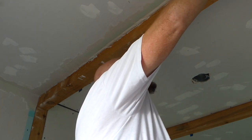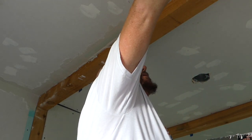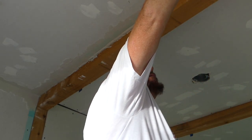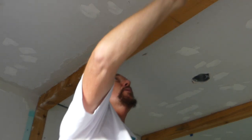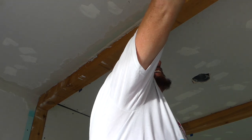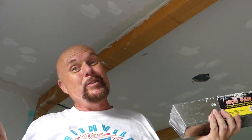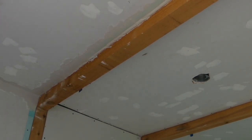We'll see, internet, if it ends up falling apart or if what I said is true, that plaster loves timber. Especially this, it's rough cut, right? And I did the right thing by avoiding adding a stain or finish or anything. It would have made it easier for the final fit and finish of the timbers, but the plaster wanted a bond. And I know that I still have to level this house. It's on blocks, so I'm expecting a little bit of character to come in when I do that. Let me move the camera.